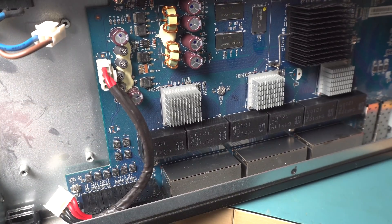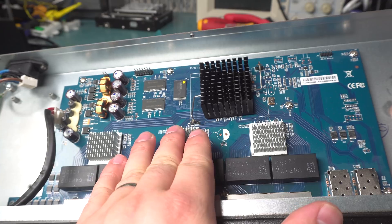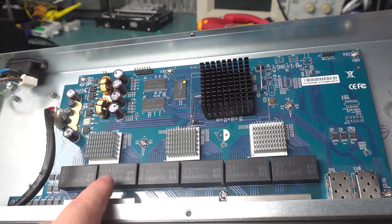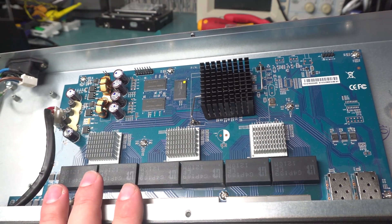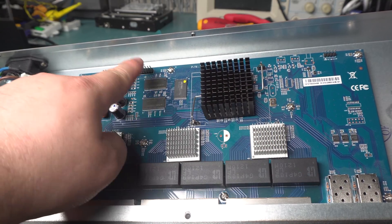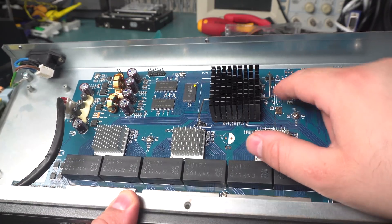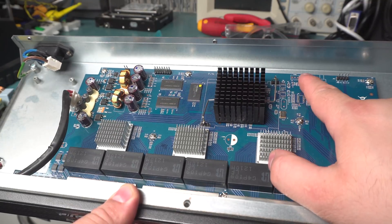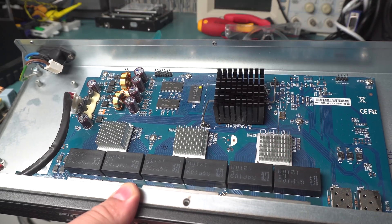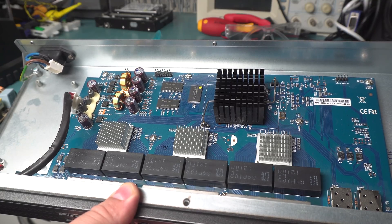This thing has sufficient cooling with nothing, so just adding a little bit of airflow won't hurt anything. The board is fairly simple — it's got three 8-port switch controllers, a switch-mode power supply, and these are all Nippon Chemicon caps, so they're fine. There's a main CPU, some flash memory, and some RAM. There's a serial port header up here, and there are two pads here for fans, plus one down here which is a two-port one. I also want to check the voltages on these because it may be for 5V fans.